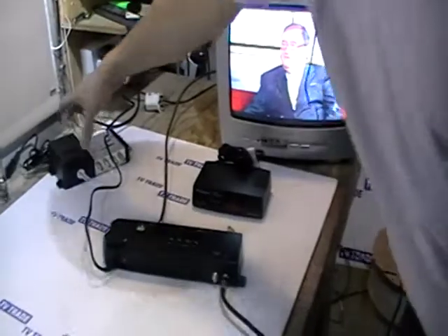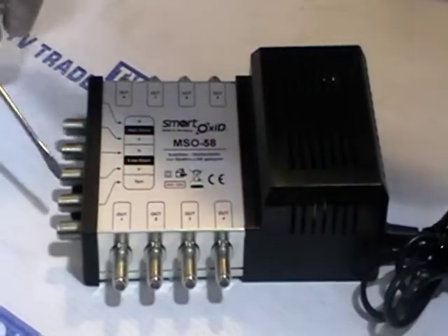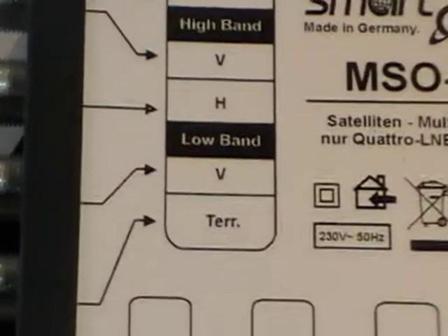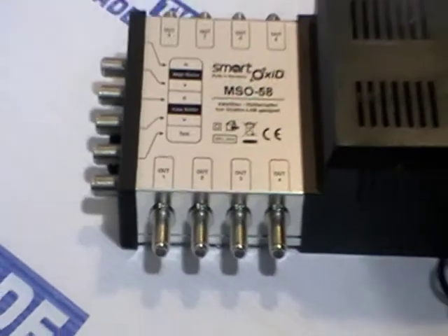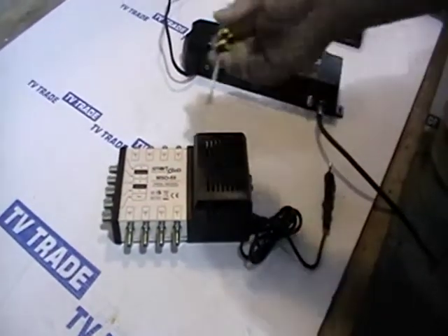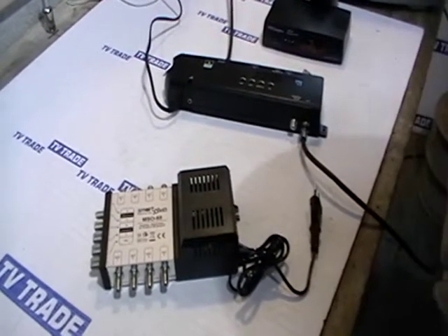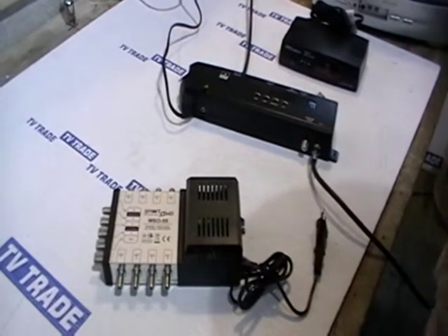Something else you could use in combination with this is a multi-switch. A multi-switch is used where you have a 4LNB and a satellite dish — you feed the four satellite inputs in, plus a terrestrial signal input, and you can feed up to 8 or 16 televisions with both a satellite feed and a terrestrial aerial feed. A very common problem is that on the satellite part it works perfectly, but on the terrestrial side the signal can be very, very weak. It's ideal to use a launch amplifier like this in combination, as it gives a significant increase to dB strength of the aerial signal, sufficient to overcome losses and give a reasonable signal on the output side. This is suitable for both commercial use and home environments where you want to combine satellite and aerial into a single cable.